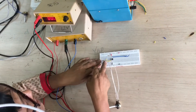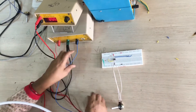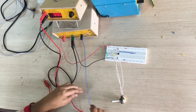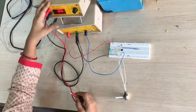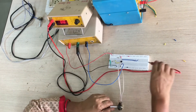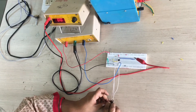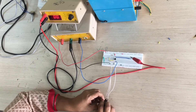In this circuit, Ri is 4.7K input. The input should be grounded when we do the offset nulling. We connect VCC to pin number 7, ground and minus 12V to pin number 4 using a dual power supply. The multimeter's negative point is common ground and is connected at the output pin number 6. We power on and adjust the potentiometer to access zero. We do the nulling because without it, whatever readings we take, the output may have error.